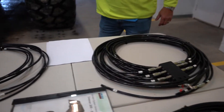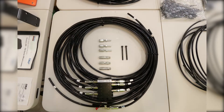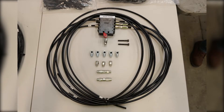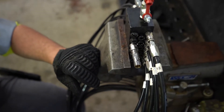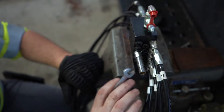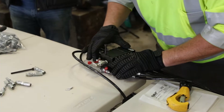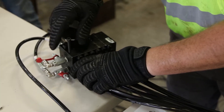Prepare the divider valves for installation. In some kits, these may include divider valves preassembled and marked for the different mounting locations. The supply and feed lines are cut to predetermined lengths for later fine tuning. Install the proximity sensor onto the divider valve configured for lubrication of the front frame components. Next, assemble the primary valve and front frame valve to form a compact valve set.